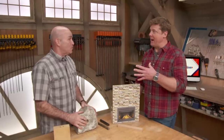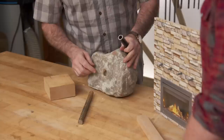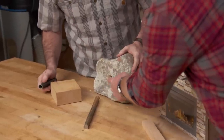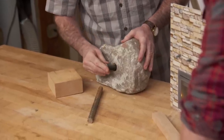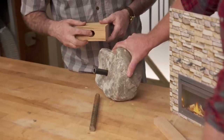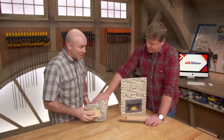And in that case you had a hollow back, but sometimes people have an old antique piece of wood, a beam or something solid. In that case, what do you recommend? I always love a post — it can be re-rod or a lead pipe. Before we touch the pipe, we're going to throw epoxy into the hole; that's going to secure the pipe. So over-drill, fill with epoxy, take your post, put it in — it'll get nice and snug right away. Then add epoxy to this end and just apply your mantle, push it in, hold it for a second, and it sets right up.